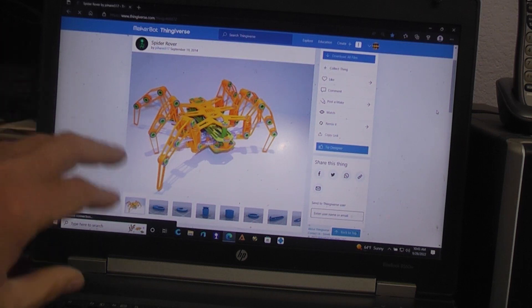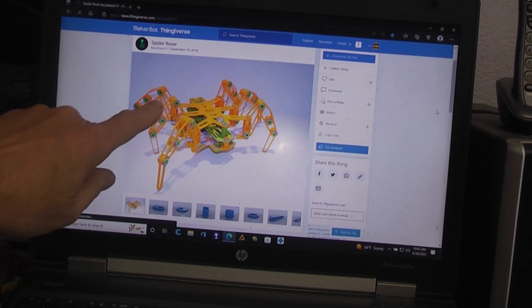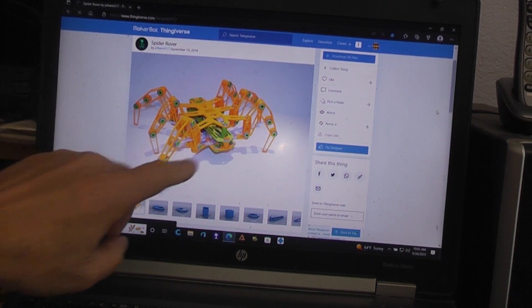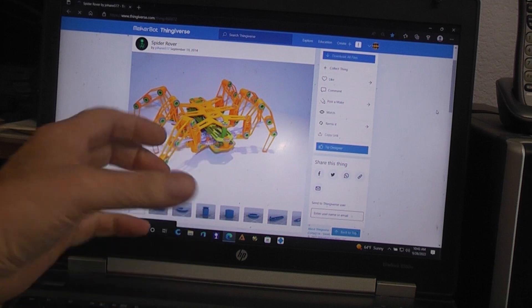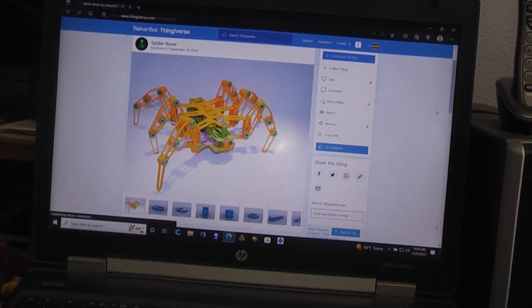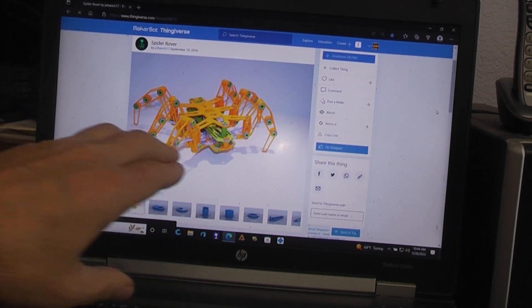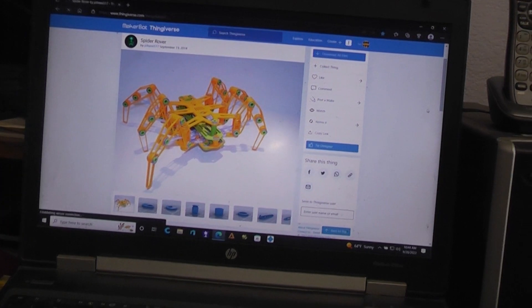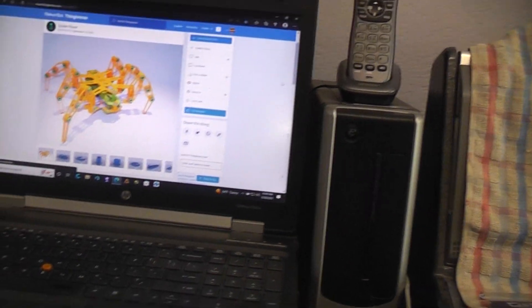A few things I wanted to change on the design to try to make it more practical. I wanted to beef up the legs to get rid of some of the slop and wobble, because you can see these are very skeletal. I wanted to change the diameter of the gears so they mesh together a little bit tighter, so there was less chance of them skipping a tooth and getting out of whack. And I wanted to reduce the scale, because that size is so large that you get a lot of flexing in the PLA parts. Anytime anything flexes, especially down on the bottom base, that makes the gears skip a tooth and get out of whack.